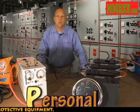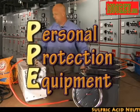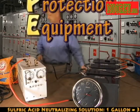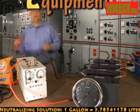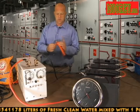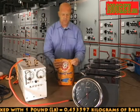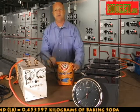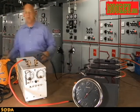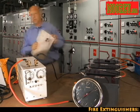Some of the personal protection equipment required for an 1188 discharge test — or what people refer to as PPE — include safety glasses or a face shield. Always good to have that. You should have insulated tools. Make sure that your tools are properly covered with no bare or exposed metal. You should also have some neutralizing agent in the event of any type of battery spill or acid coming in contact with anybody. This will help neutralize the acid. You should also have fresh water and protective gloves.